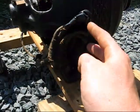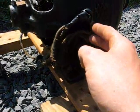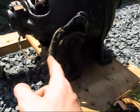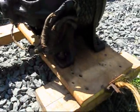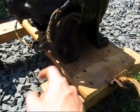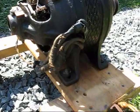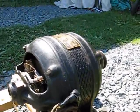There's four wires going into the side of the motor. If you change them around and use three wires — because right now it's separate four — if you hook two of the wires together in a different fashion, you hook the two ones in the middle together, and then you add another wire going in, that allows 220 volt lines to go in at the same time, one wire going out.